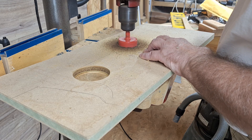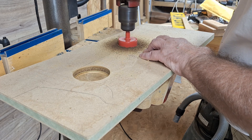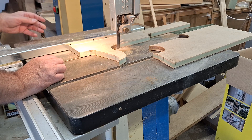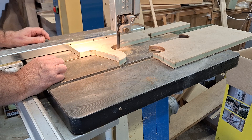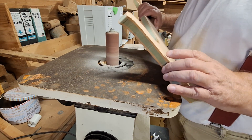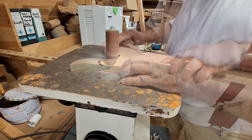The handle is a piece of 18mm moisture resistant MDF. All the internal curves are made with a hole saw, and then it's bandsawed to shape. Then a few minutes on the drum sander — you can see the sort of problems I'm getting with water ingress at the moment — followed by a roundover bit on the router table to make it comfortable.